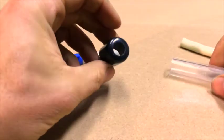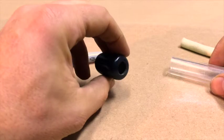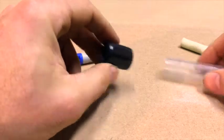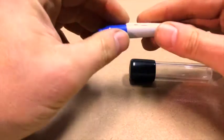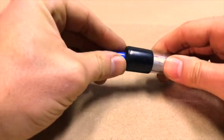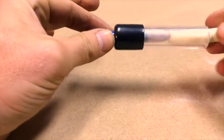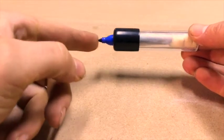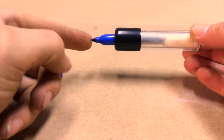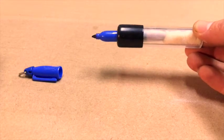This here is just a rubber end cap from McMaster-Carr. I had a half inch punch and punched a half inch hole in the end. So that goes on there with the marker cap off, slides in, snaps past there and holds it. And then with this in your collet, this butts up against the back of your collet and it acts as a little spring, so you're not smashing your marker into the table.